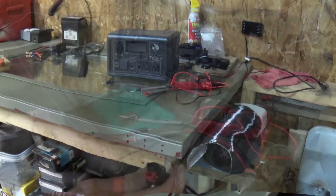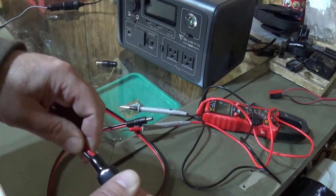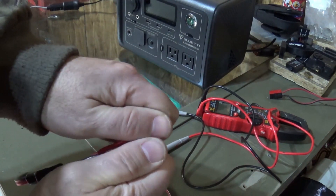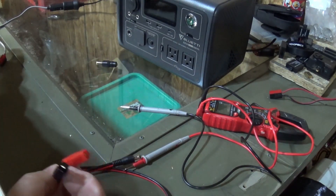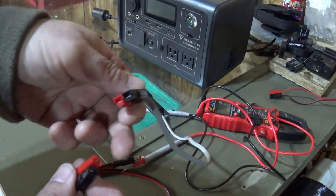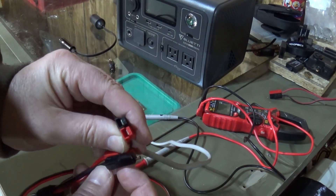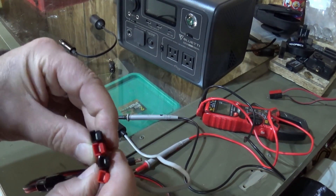It's really straightforward, easy fix. You can see the way I do these is I've got them side by side, so there's no way for this one to plug into that. To change this around, what you're going to do is just pull this jacket back and you can separate these, and then you can put them together side by side. So I want them to mate with this — I'm going to put the red on the right, black on the left.